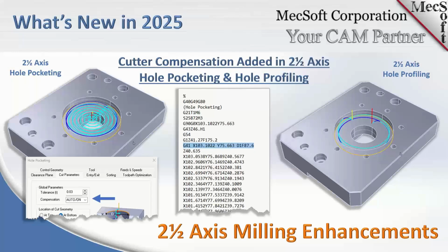I did just want to mention that if you have a hole that you need to cut and you need very tight tolerances, up to 6 or even higher if you need it, hole pocketing and profiling is the way to go. You can get very tight tolerances, like if you've got a press fit or a loose fit, say of a bearing or a sleeve or something. This is the method you want to go to. And now that we've added cutter compensation, it makes it even better if you're cutting production holes or just if you want to use the compensation feature in your controller.